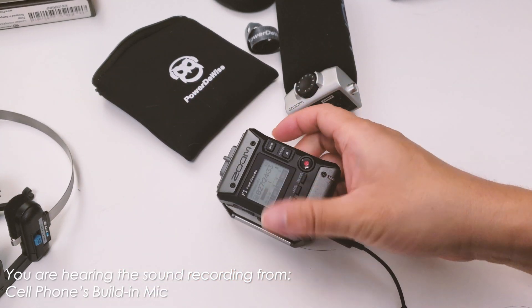What I'm going to find out today is the loudness of the gain settings on the mic input. In a few moments I'll switch to the recording on the F1. We're going to use 48k and 24-bit wave setting. I have a 4 gig memory card, so with this setting I can record about seven hours of audio, which is fantastic. The limiter and low cut filter are both set to off, and we're going to start with the automatic setting.